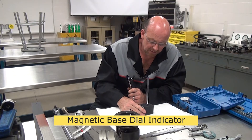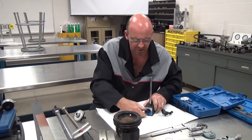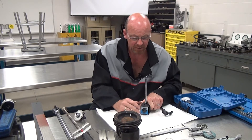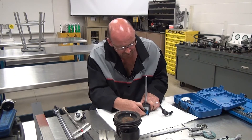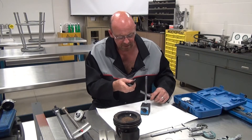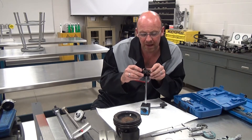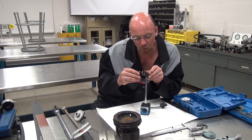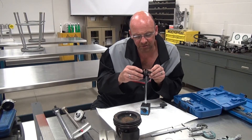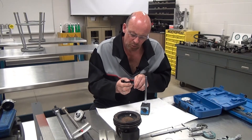The next tool we're going to take a look at, and it's a pretty common tool, is our magnetic base dial indicator. The magnetic base here has an on and off switch. When we are using this, we can turn it on or off to get it to hold onto a particular portion of the block. We can turn it on to lock it into place, then set the tool up — though sometimes you've got to fiddle around with these quite a bit because there is a split collar on these brackets that we have to loosen and open up.